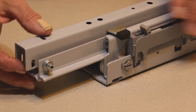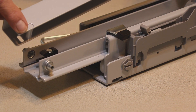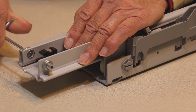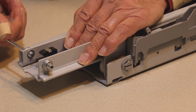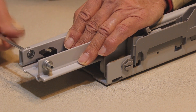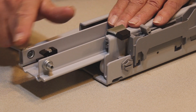Now we have the carriage extended enough so we can see what's going on. Again, the upper guide with the slotted holes — these pins that you can see right here. That pin will go into the slotted hole. When you screw these pins in from both sides, that secures the upper guide so your pantry pullout unit can't accidentally get jerked out of the cabinet.